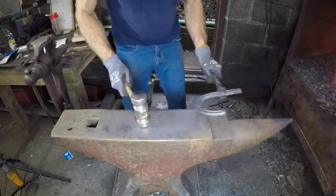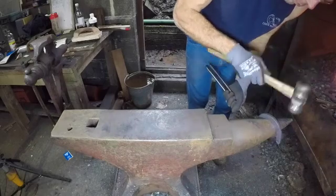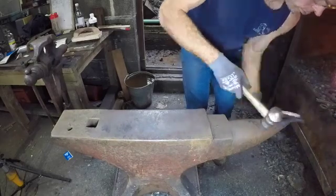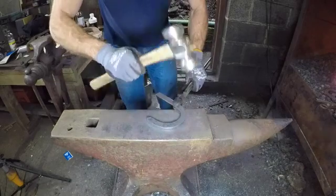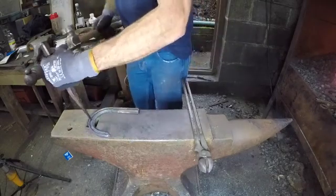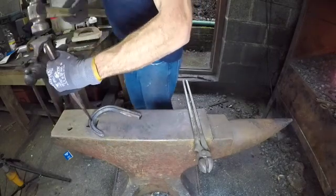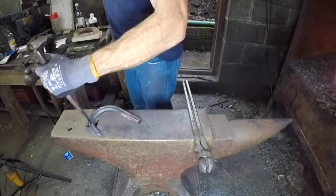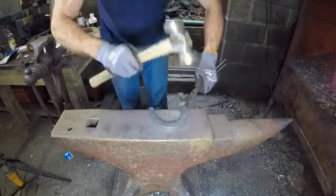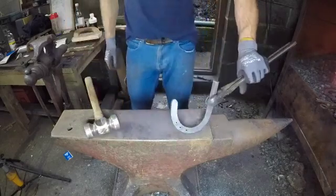Some stock shoes you'll want to put four or possibly five nails in. Flip the shoe over, level the foot surface and just take out any light bubbles or ballooning caused by your stamp — you don't need to work it very hard, lots of little light taps. You can also use this moment to adjust your shape. Then get the pritchell, holding it as we discussed so you can see what you're doing — one firm blow, possibly a second if needed, then a quick dunk in the cooling fluid or saddle soap and another quick firm blow. The pritchell shouldn't be working too hard; the stamp does the lion's share of the work, and then the pritchell does a nice clean hole at the end.